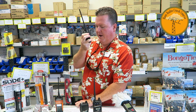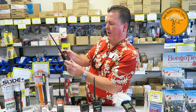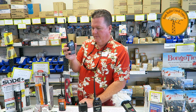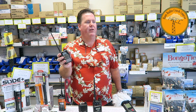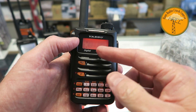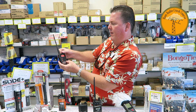KB6CIA on Sunset, testing. [Contact established] Hi Russ, thanks for coming back — just demonstrating how the FT-70 works on digital. You sound great. [Russ responds — partially unclear indoors] Roger that — sometimes being indoors makes a difference. Thanks for the quick demonstration, KB6CIA. So there you go — that quick, punch in the frequency, put it in digital mode and you can talk on the repeater. When you're done, store it by holding the memory button for two seconds — same function as analog — then dial up the name of the repeater, like 'Sunset,' and hit Band to scroll over.